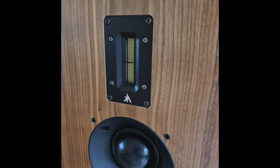So there's a couple of unusual aspects to the design, aren't there? There are, particularly with regard to your treble units and these little ports at the bottom here. Absolutely, yeah. Well, it is a transmission line speaker. Like all of the Kerr Acoustic range, transmission line bass loading is at the core of the design principle. We're using, of course, the true ribbon tweeter that we've got in our other models as well. There are several bits of trick technology in there, but two of the real USPs are the combination of the transmission line and the true ribbon as well.